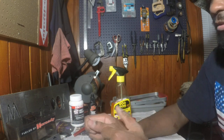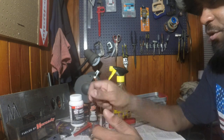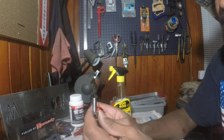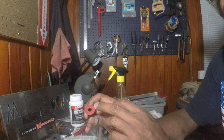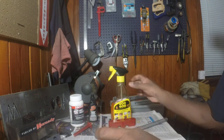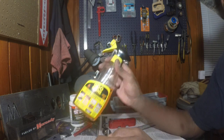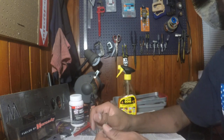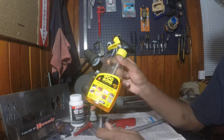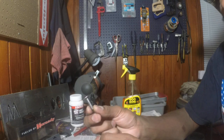For now, because you have steel components, some of it will have surface rust. For example, this is the anvil for seating new primers. I had to use some cleaning solution on this. I use Goo Gone, by the way, for all the plastic parts. Anything that had powder residue on it, Goo Gone works very well. I guess you could also use Hoppe's number 9 since it's a powder solvent, but I found this stuff works very nicely. But there was some surface rust on the anvil.